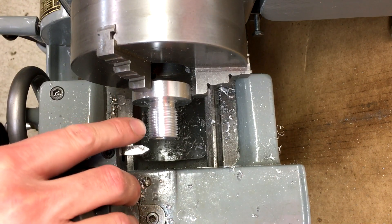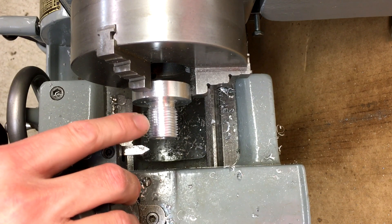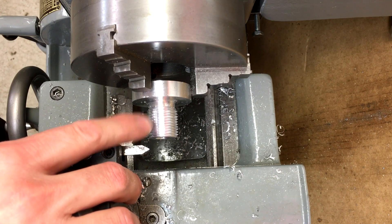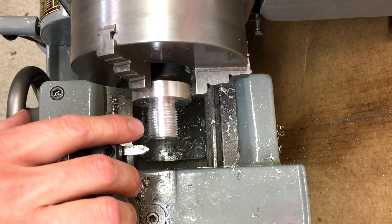The saddle itself is too big to bring over here and thread in, so I'm just going to go with the number that the machinist's handbook says for a 14 TPI thread depth, and we'll take it out and try it after that. We should be on just one more spring pass here and then we'll pull it out and try it.